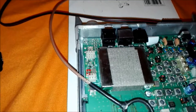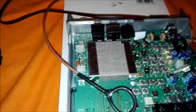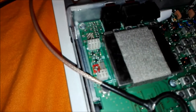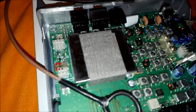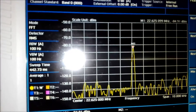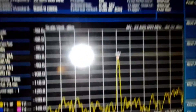The Yaesu FT-817 is off frequency. As I just read through the maintenance manual, I found that this is the reference board for the PLL and all the other local oscillators. This board has a crystal with a nominal frequency of 22.625 MHz, and it's a bit off frequency.